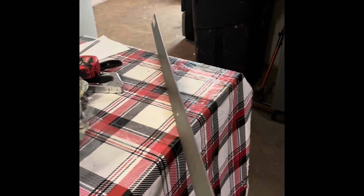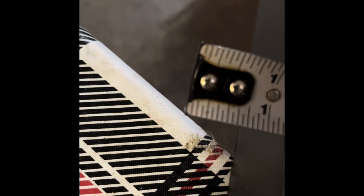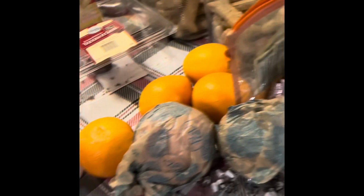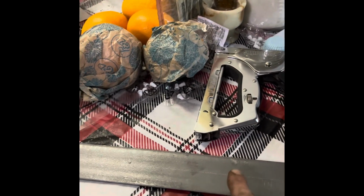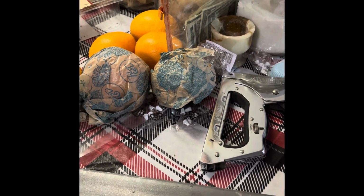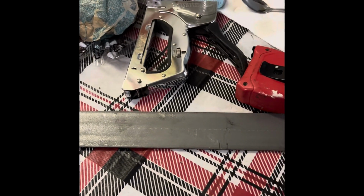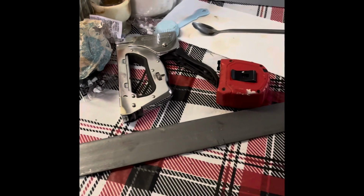But anyway, here's that piece of strap steel I bought today. I don't know what size it is. I think it's written in metric or something when you buy it, and I don't know my metrics very well. But it's 1/8 of an inch. I'm going to use this to get that A-pillar reinforced and that bottom hinge reinforced. Between this and whatever I build up here with this and the 18 gauge, we'll get something working. Don't worry, fellas. I don't know what yet. It'd be trial and error, but something will work somehow.